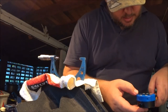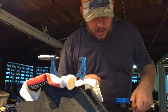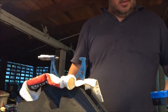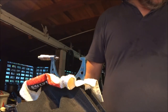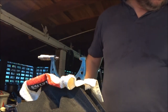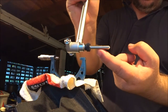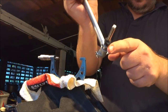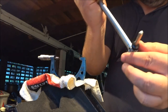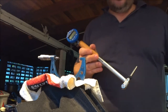That's not worked. Let's start again. Press 0 to turn on — it is on. Set size — done. Calibration — that's that. Setting size is putting the correct anvil on here. This is an 85 with a 1 millimeter spacer hidden under there, which is 86 millimeters. And our bore is 86, so it should be pretty right.